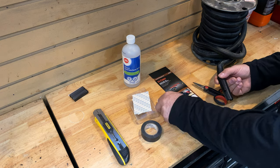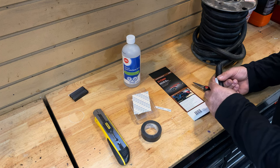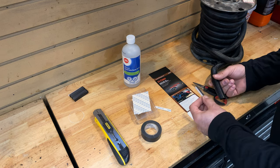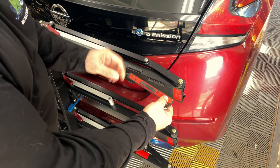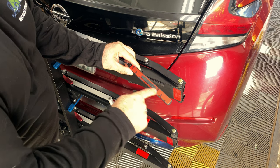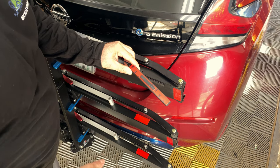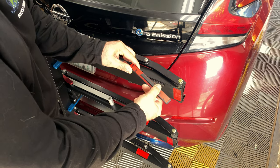After wrapping with electrical tape, place the matching magnet so you know it's oriented correctly. Clean the surface with alcohol, peel one layer of backing, stick it on, then wipe the next surface with alcohol, peel the remaining back, and stick it where you want. That way you know the magnets are lined up without having to measure or second-guess yourself. For the lights, I placed the magnet on the back where there's a 3M adhesive already there — I cut out just a section of the backing with an exacto knife and stuck the magnet right to that existing adhesive.